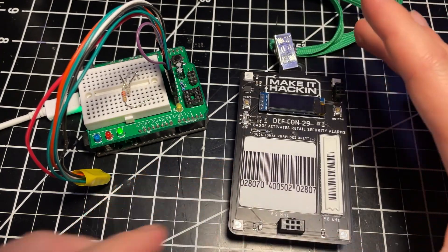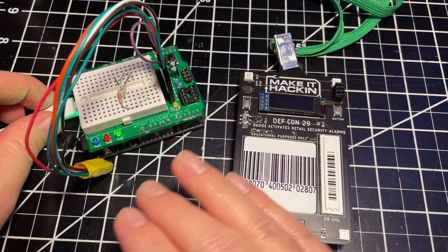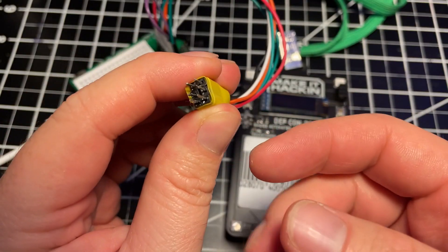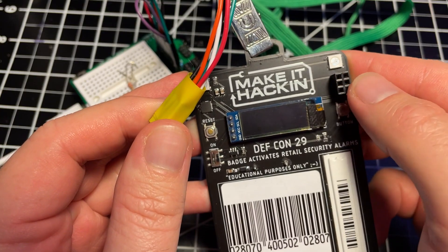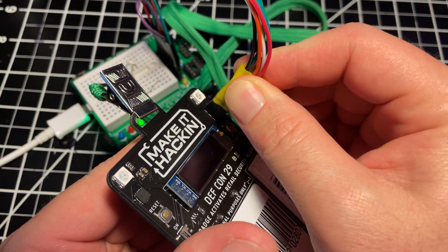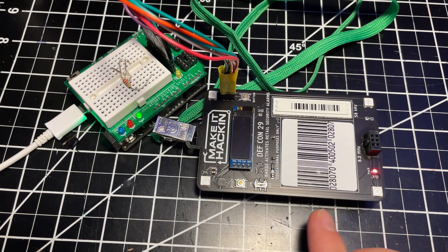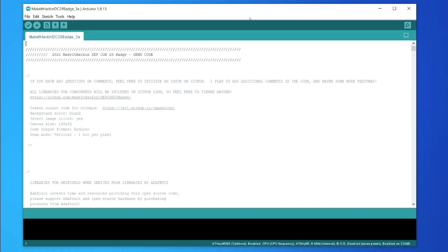To program the Make It Hacking badge, you need some kind of AVR programmer. If you have an Arduino Uno, you can use one of those. How to set that up is beyond the scope of this video, so I will link a video in the description on how to set up an Arduino Uno for programming an AVR chip like this one. Basically you need six pins — it's called in-circuit serial programming. I already have my six pins set up, and the documentation will show you which pin goes where. The upper left-hand corner is where the ground goes. I recommend having the switch in the off position, and when you plug it in you should get your power light on. Depending on how you have this configured and what kind of bootloader you're using, you may need to burn the bootloader before you upload. So right now I'm going to burn the bootloader.